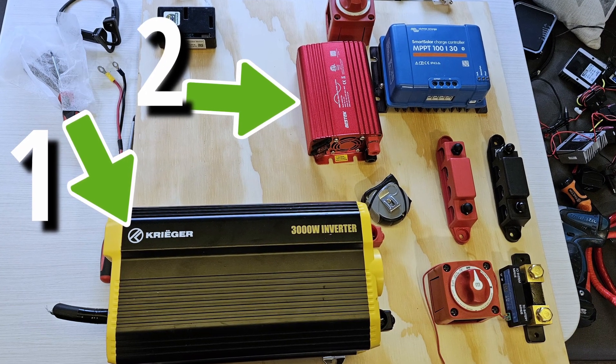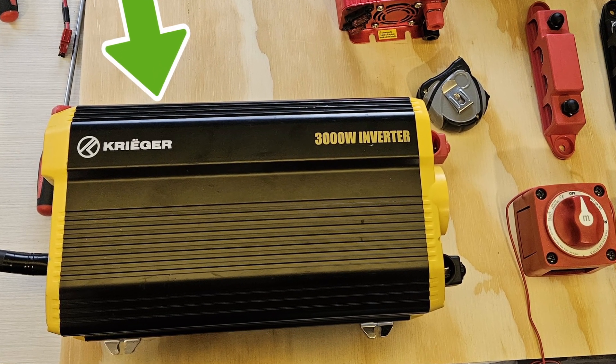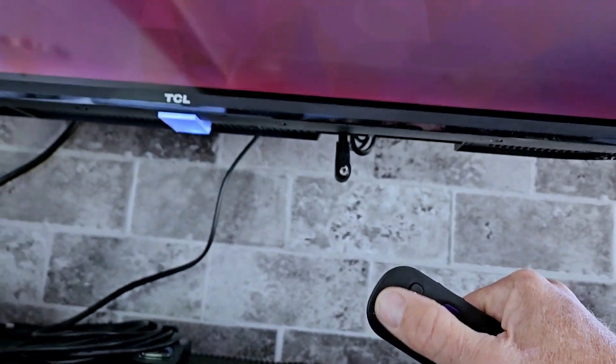For this test, I've got two different inverters in my camp trailer. The big inverter is a 3,000 watt inverter — it draws a lot, three amps sitting at idle, and more under load. But 3,000 watts is a big deal when you're trying to run a microwave, maybe a hairdryer, and a straightener or curling iron. The other inverter is a 300 watt pure sine wave inverter.